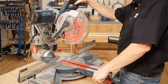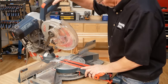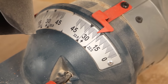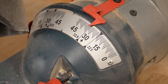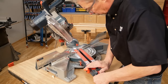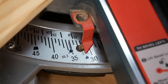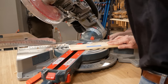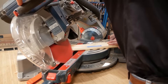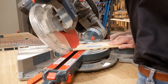To make the left side of an outside corner, tilt the saw bevel to the left and set it at 33.9 degrees — your saw probably has that bevel angle marked or maybe even a positive stop. Swing the saw table to 31.6 degrees left, and again your saw most likely has a stop there. Now place the bottom edge of the molding against the fence and make the cut. The right side of the work piece is your molding.